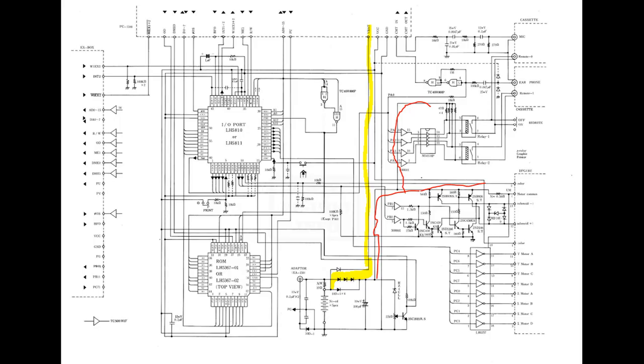The way the battery pack is used is also odd. The battery voltage is only used to directly drive the printer and relays — this is the red line. It's also fed through a diode up to the computer as VBAT — this is the yellow line. The power supply in the computer regulates this down to about 4 volts, called VCC, which is fed back out to the CE-150 to power the circuitry therein.